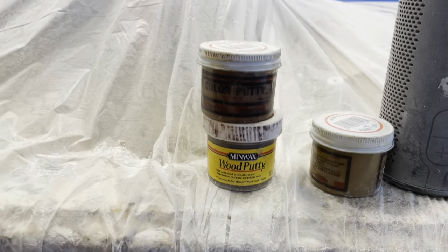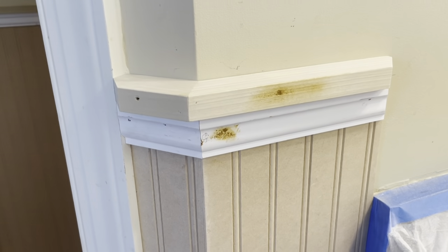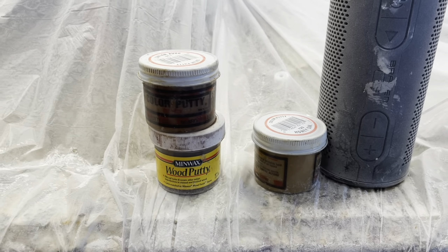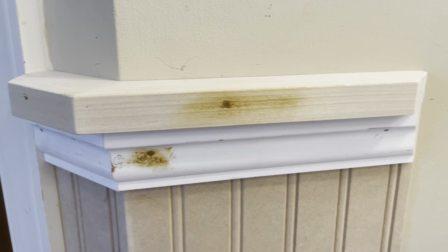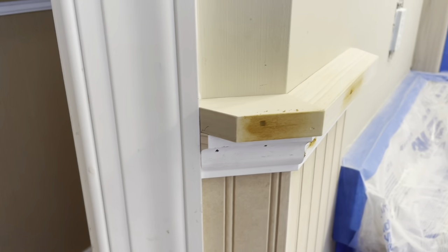It got a little dusty in here, so we'll vacuum up some of this dust and then start caulking, puttying, and spackling some of these patches. Normally for my putty I'd use Crawford's water-based white putty — it dries white — but Sherwin-Williams doesn't have it, big surprise there. So I'm just going with what I have in my truck. Normally I'd use this for wainscoting and chair rail and door jambs getting a stained finish with polyurethane on top, so it has a brown color and it's oily. But it really doesn't matter because I'm using a stain-blocking oil-based primer followed by an oil finish paint, so it'll be just fine. Just throw a little in the hole and rub it in with your finger, and we'll come back later and sand it down.